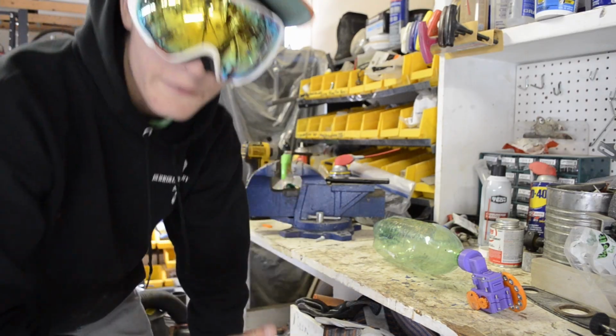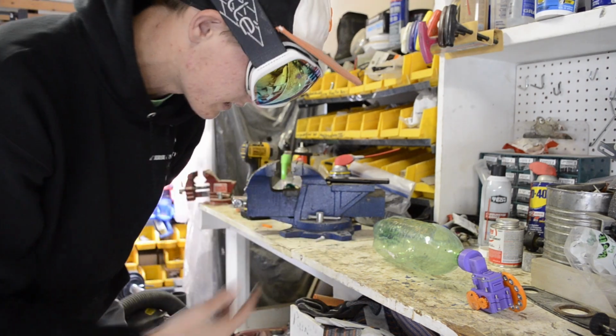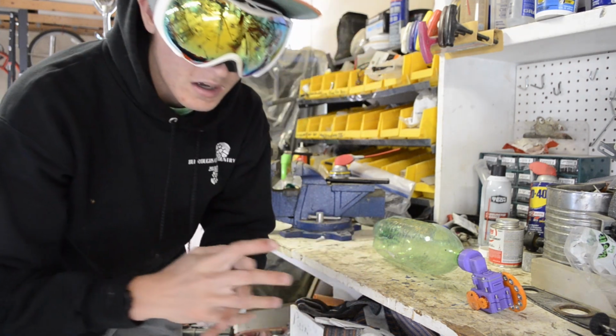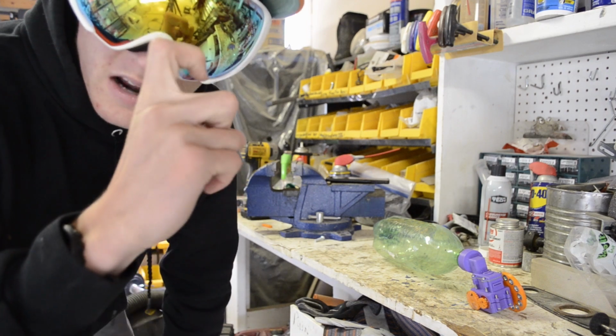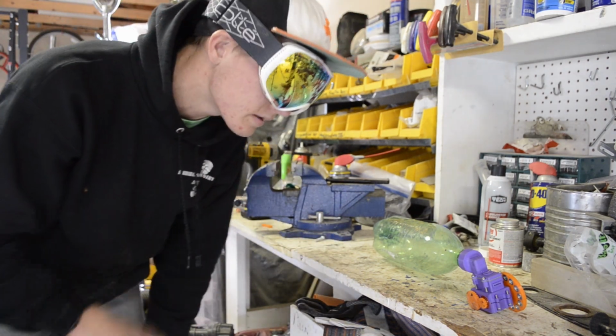Okay, so I think I fixed the problem. It at least is no longer leaking as bad. It still leaks, and I'm pretty sure that is from the bike pump thing. But now, it no longer bleeds through, and I'm pretty sure that's because the push rod was slightly too big, by like probably 0.6 of a millimeter.